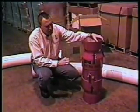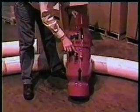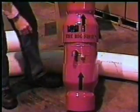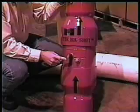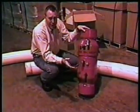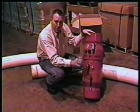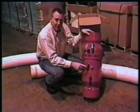Let's take a look at the unit itself. As you can see on this unit, it is half-inch into the actual mechanism of the unit itself. Immediately, we pipe that right up to three-quarter inch. It's very, very important that we use a minimum of a three-quarter-inch size airline. I recommend 1-inch — it's just better for the CFM going through the unit. If you neck it down to a half-inch, it won't work. So remember, it's very important that we have a three-quarter-inch airline supply.